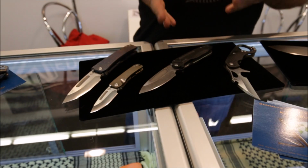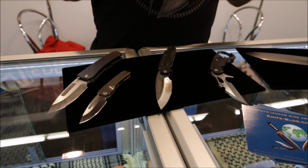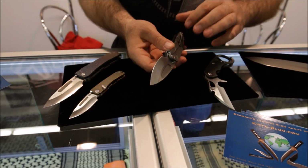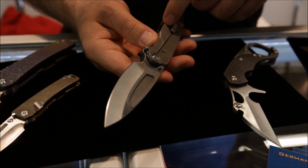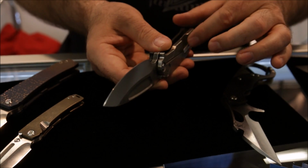Perfect knife. The only thing that's different, and I know you very detail-oriented Germans are going to pick up on this, is the relief in the production knife, which I put on the inside. We do a lot of our knives with the relief on the outside, but because of the scaled down clip, it causes some interference.